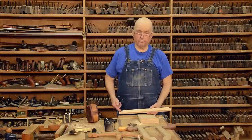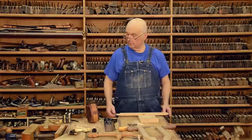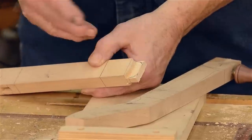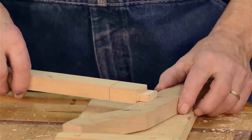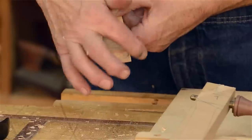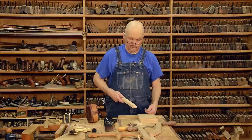I've finished cutting the shoulders to each of the tenons here all the way around, curving them with several cuts of the chisel. The only other thing to do is to cut the length of the tenon to match the depth of the mortise it's going to go into. Remember that mortise was three quarters of an inch, so the distance from the shoulder to the end I want to be less than three quarters - I made it five eighths. It doesn't have to bottom out; it's not getting its strength from being tight in there. We just want there to be room for this stretcher to rotate through the mortise. For that reason I've also laid out some bevels here to make this stretcher more of a rounded shape.